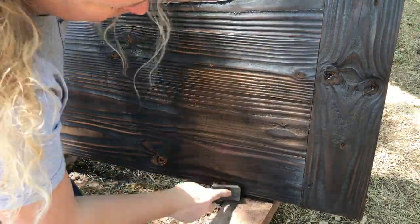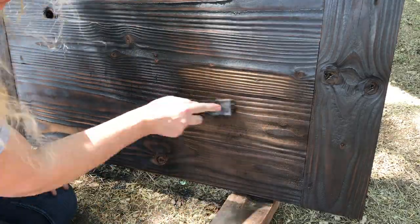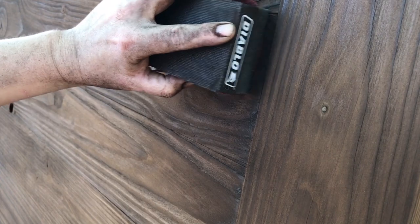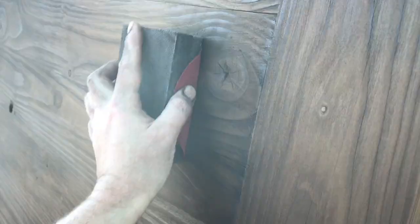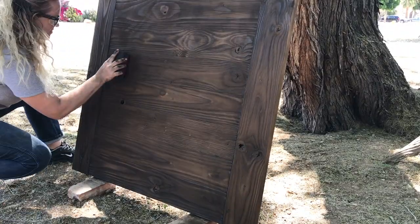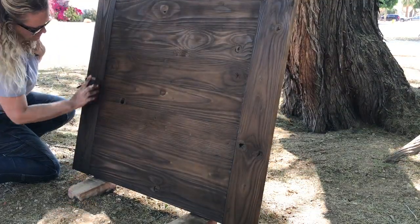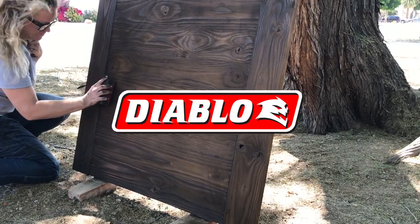This is one of my favorite parts where you can really see the texture come to life. Once I got it where I liked it, I hand-sanded the wire brush marks out using Diablo's new reusable hand sanding block. It has soft foam on one side that's perfect for getting into all the little nooks and crannies the burning created, and a dense foam side that's great for rounding over edges. It uses Diablo's sand net paper that lasts forever, and when it runs out you just add another sheet on the reusable foam. Thank you Diablo for sponsoring this video.